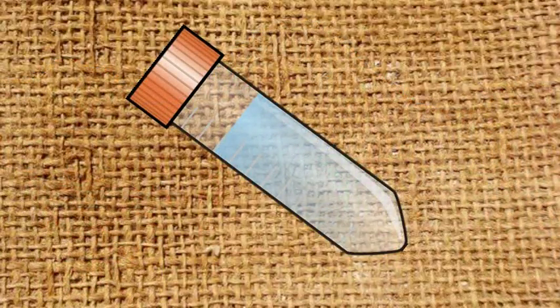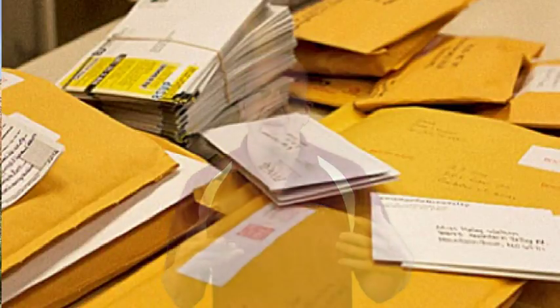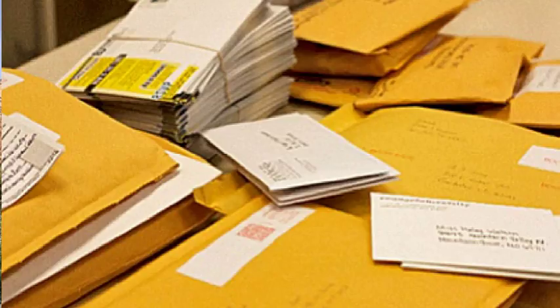So, how to sample. One of the things you're going to want to have at your disposal is either a Ziploc baggie or an airtight container. If you go to ALS, you can get a little vial — a sample tube available from ALS. The goal is, once you've got the asbestos-containing material captured and in the container, you want to make sure the container is not going to rupture or break. You can imagine the nasty scenario if you put it in a loose baggie and it ruptures or leaks asbestos out. Maybe you've mailed it in a standard mailer, and the lab opens it up and now they've got asbestos fibers all over their lab and have to take extraordinary steps to continue providing reliable service for every other customer.